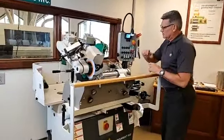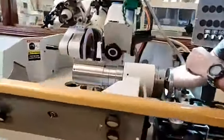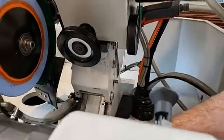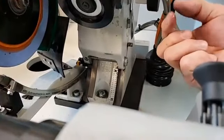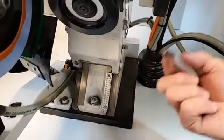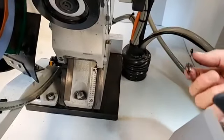Christian, if you want to move up here just a little bit, one of the important items about greasing the grinder is we have to grease it enough that we're pushing all this grit and grime, and the stuff that we're producing is just like wet sand, okay? So it's going to be abrasive on everything. So the more often we're pushing all that abrasiveness out, the more we're truly lubricating the metal.